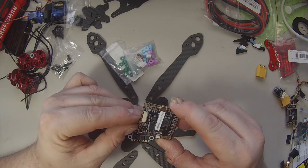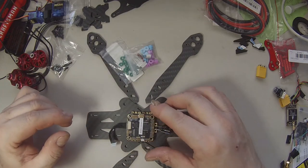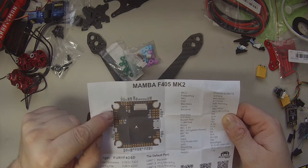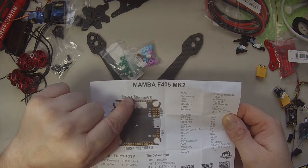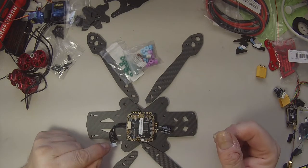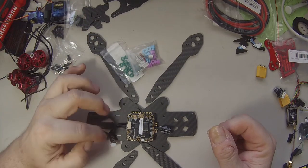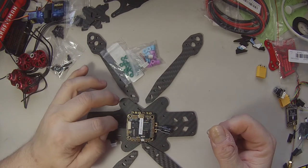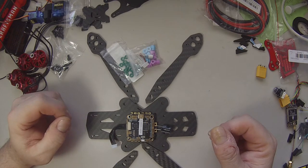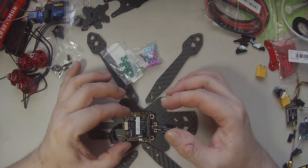The board has solderable pins all along the front of the connector and they are mapped out on the insert for the Mamba. So we either pull the pins and remap them into that connector leaving some blank, or we clip the ends and solder to the board. If we clip the ends we can make this nice and short without all the extra wire — we'll figure out which way to go as we go.